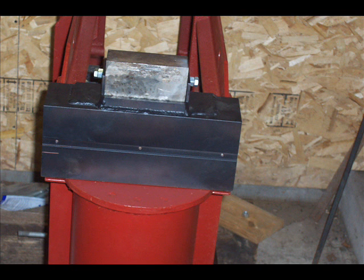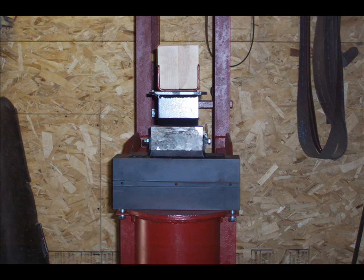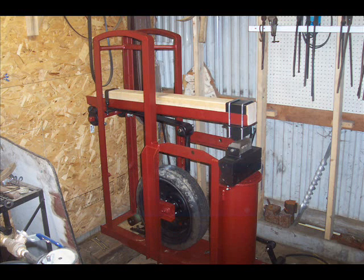The lower die bolts in place on the mount side where we welded our anvil block. The way I did that: you have a flat die face, and if you loosen it up you can rotate it back 90 degrees and you have a fullering face — so we have both flat and fullering dies made in one block. The top die clamps in place with a pair of U-bolts and a layer of steel to protect the wood, and I got that all trued up and lined up so they meet parallel and straight.